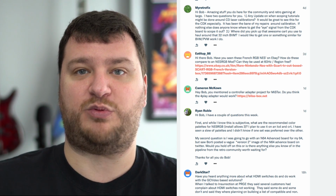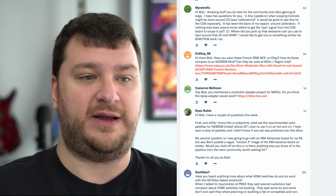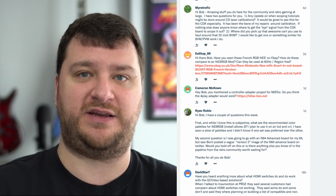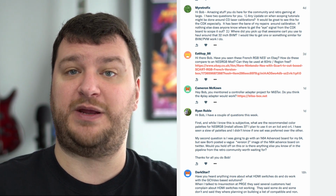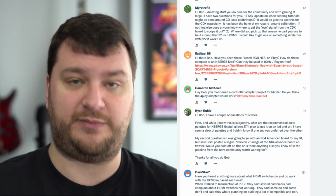That's something that probably nobody else in the world would care about but me, but I think it would be very cool. But that's going to take a lot of work because I want a special board designed to make sure it's as good as it can be. Worst comes to worst, I could take this, do a full recap and a region mod, and put a NES RGB kit in it and just wire it up to that multi-out.